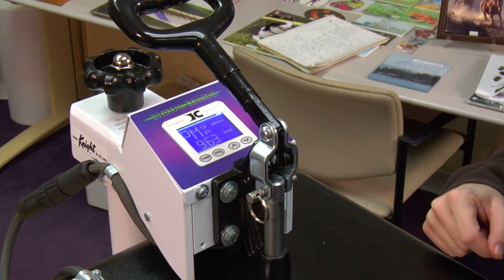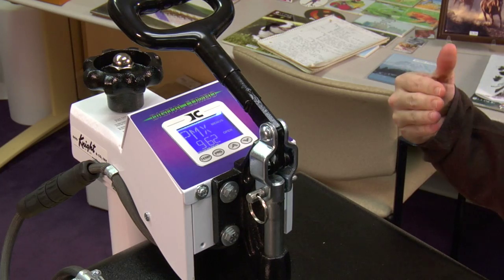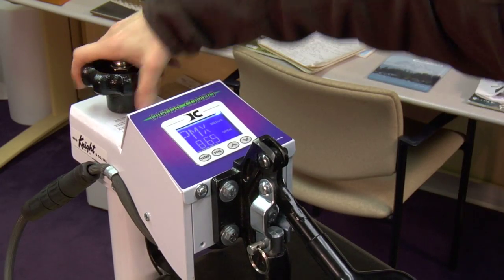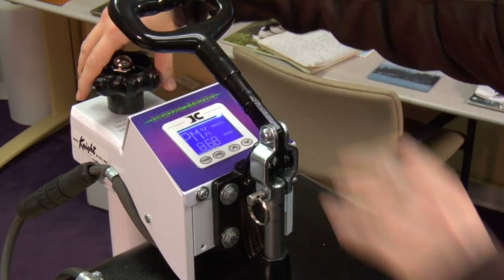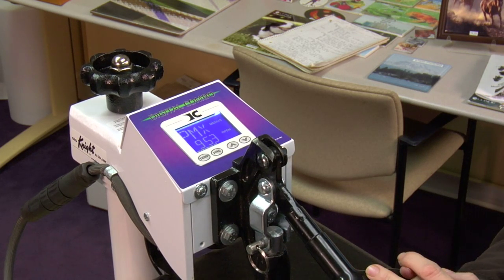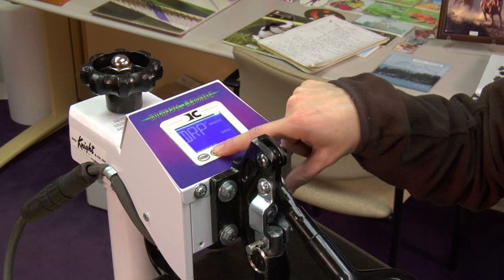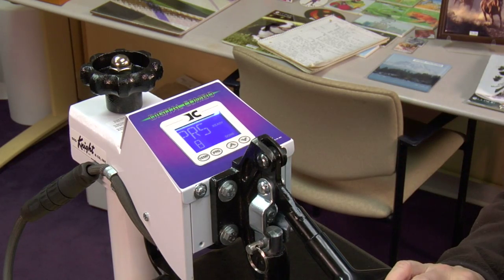Now we go to PMX, which is the maximum pressure. We're going to tell it what nine is — nine being the maximum. Lower your press and turn the dial until you can't turn it anymore. That will vary based on who's turning the dial. Raise it up and turn it about another half a turn so that you have a really heavy pressure. That locks it at very heavy pressure and that's when we press up or down to tell it what nine is, nine being the highest. Now we're ready to just program back out — keep clicking program until we get to the very end and it goes back to normal user mode.